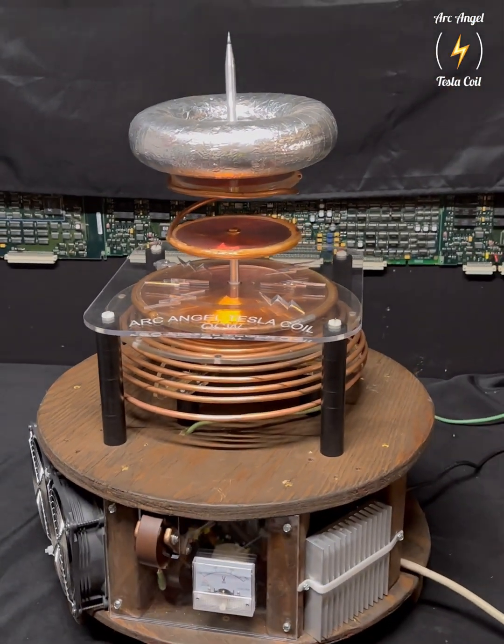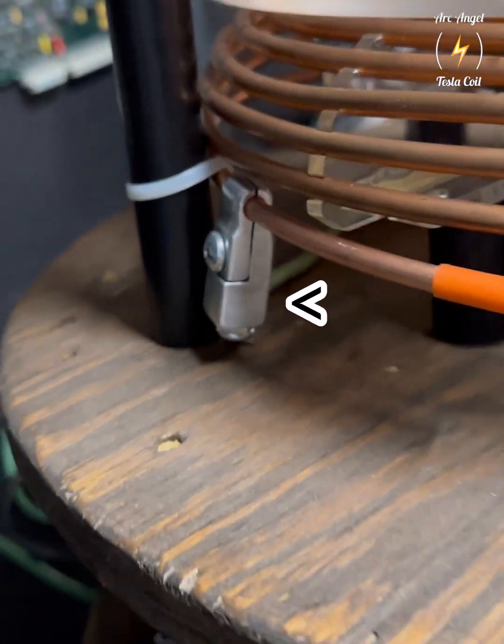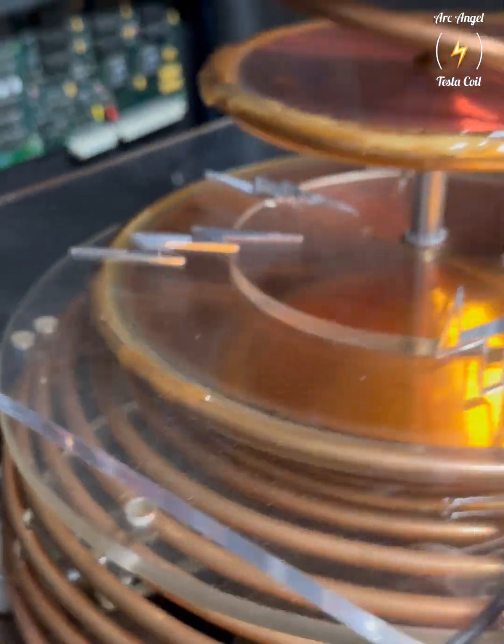There's the driver and the 24 volt power supply. Behind here is the rectifier on the left hand side. There's the DC bus caps where the rectifier connects to, and then going to two SKM 100 half bridges. Here's the primary tap on about the 13th turn, and it goes in through the wood right here. The primary cap is running 8 nF, consisting of two caps.